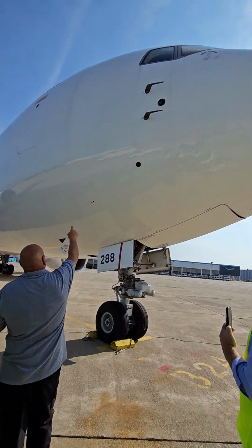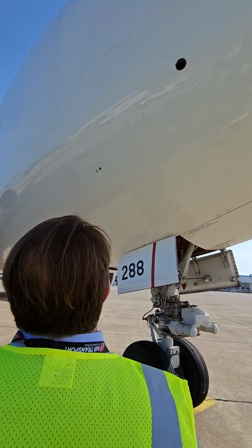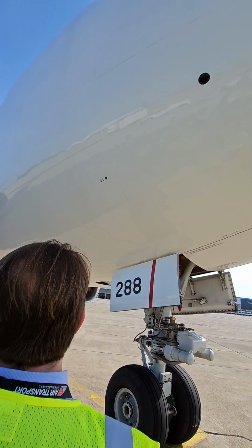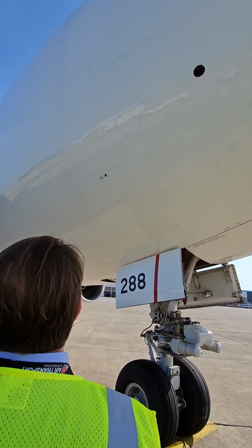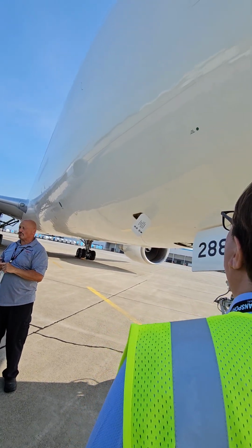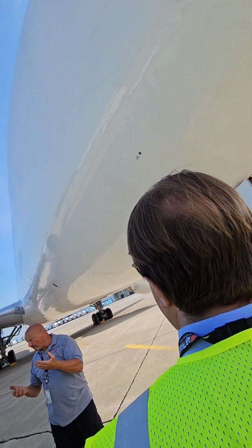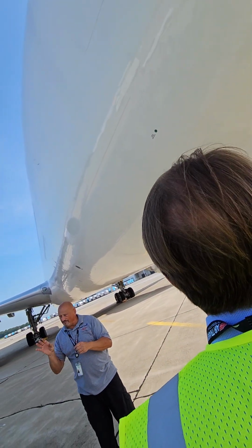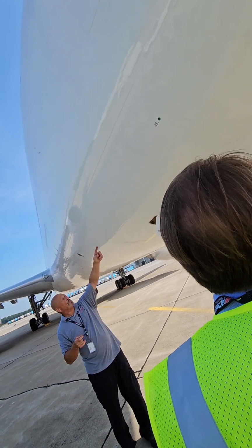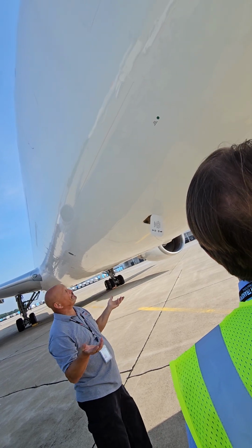All right. So, that green disc, your crew oxygen bottle, or bottles, depending on the airplane, is in the forward cargo compartment up against the forward wall. If that bottle is subjected to high temperatures, I think it's Boyle's law that says an increase in temperature causes an increase in pressure. Well, there's a relief valve so the bottle doesn't explode. That relief valve opens up, it blows that disc out. So when you're doing your walk around, you go, hey, what happened to my disc?